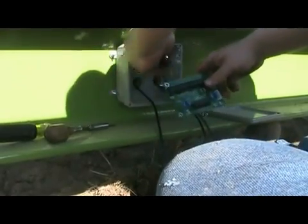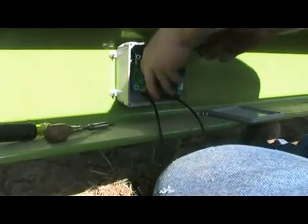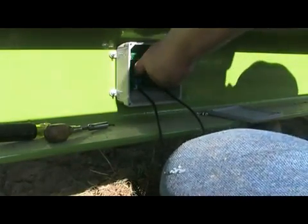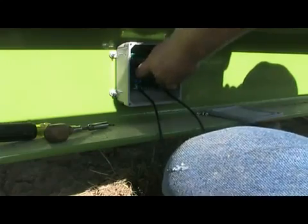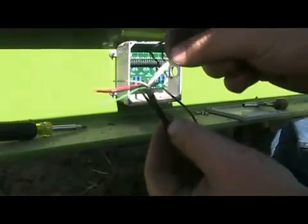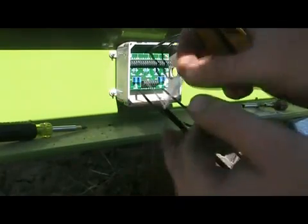Reinstall the circuit board. The circuit board is numbered with the same number of load cells that are in your scale. Connect each numbered load cell to its number on the board. For example, 1 to 1, 2 to 2, etc.